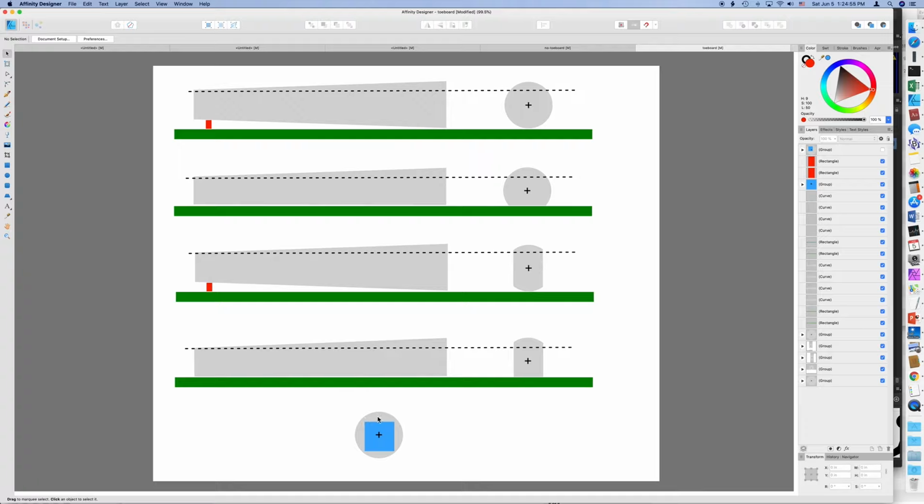What we've taken off of that log is very minimized in terms of waste, and you can see the cant goes out very close to the corners or the edges of the original log. And so this gives you an idea how much better it is to saw with a toe board. In fact, I can bring up this other cut to compare.